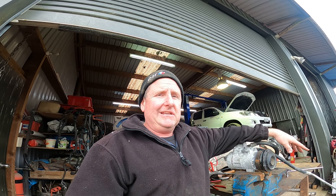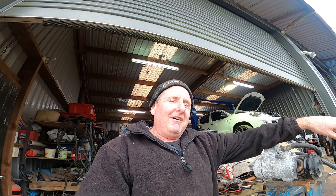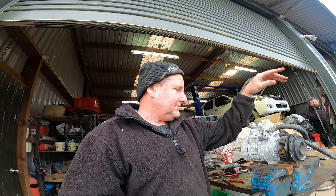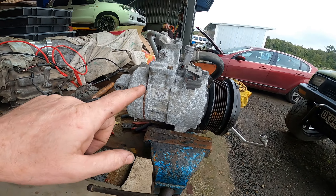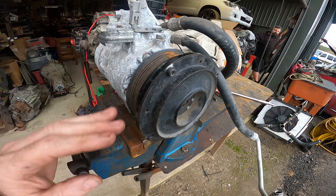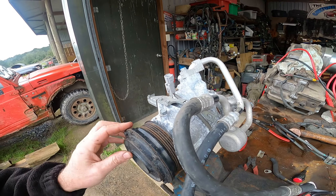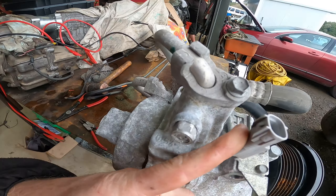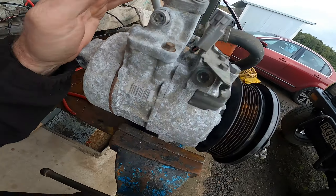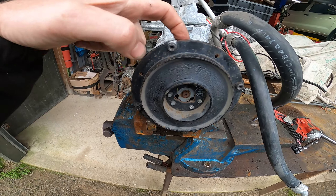I've been calling them all sorts of names. The pump we're referring to is this one — it does not have a clutch. There is no clutch; it's direct drive. There's the shaft for the pump and it is turning; the whole pump runs all the time. What it does have is a pressure solenoid, tucked at the back here. The wisdom of the internet said 'hey, that's where the clutch is,' and someone wanted to change his front bearing.